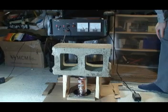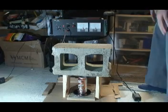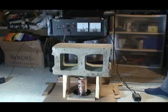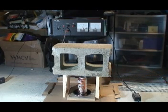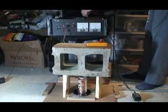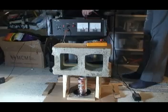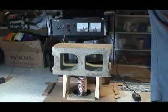Okay, we're charging. The reading is 0.5, so that would be one and a half kilovolts. It doesn't hold very good — smells a little toasty. That would be one and a half kilovolts. My meters don't even go that high; they're 1,000-volt max. We could take the voltage across one capacitor and multiply it by 4. Each capacitor is at 350, so that would be 1,400 volts. So we're pretty accurate.